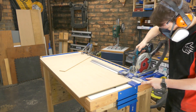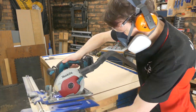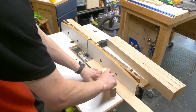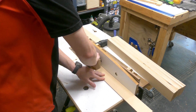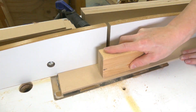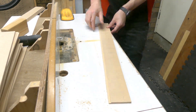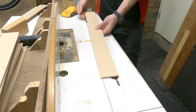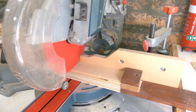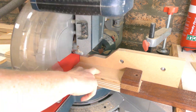My circular saw handled the drawer pieces one after the other — we cut that many drawer pieces because that's where we were at. The frame honestly went together pretty quickly but these drawers kicked my ass. It was weeks of part-time work, a couple of hours here, a couple of days there, getting everything sorted. The router table — getting things done before you cut them to final size was really nice. That lower groove, rebate, rabbit, whatever you want to call it, is where the base is going to go — just six mil MDF again, sitting flush.